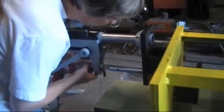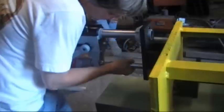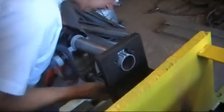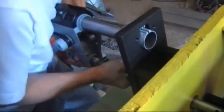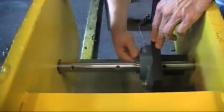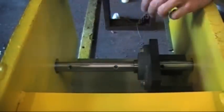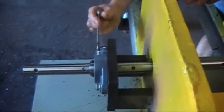Install the drill into the drill press adapter — a variable speed Milwaukee drill. The trigger will be held on with a Velcro strap. We have a lining-up problem here. Any alignment problem can be cured by loosening the bearings and re-tightening them in position. This will move everything just an ever so slight amount, which when you bore it will all come out just fine.